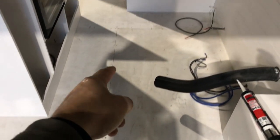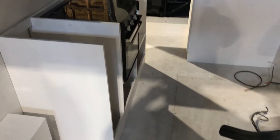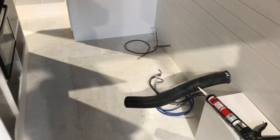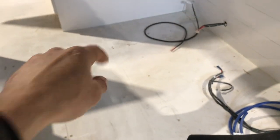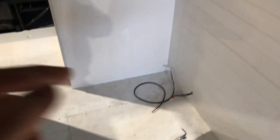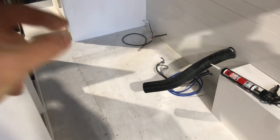One thing that's really important is that everything is measured off of a centre line in this conversion, because the walls might be at different angles in different places down the van. We run the centre line all the way down and then all the cabinetry is scribed so the front edge sits on the line. You can see this faint pencil line here — that's the line where the cabinetry on the offside of the vehicle is going to sit, running parallel to the centre line.